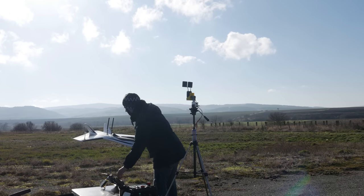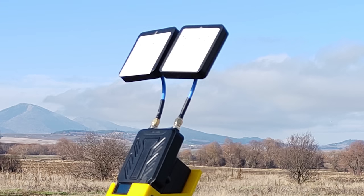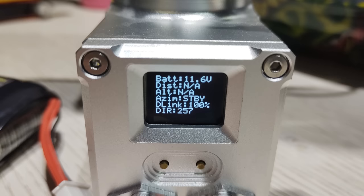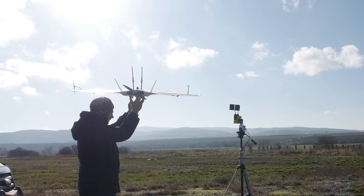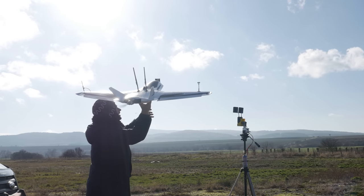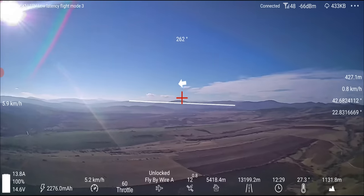I also replaced the stick antennas with the small patch antennas provided with the system. After powering the system on, the tracker was seeing a valid data stream from the ground unit, so all was good to go. In order to test it in stages, I decided to start again from the five kilometer mode and see if these directional antennas are going to make a difference when it comes to range. The duck was off and the test was now underway.